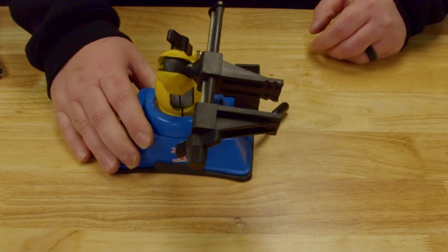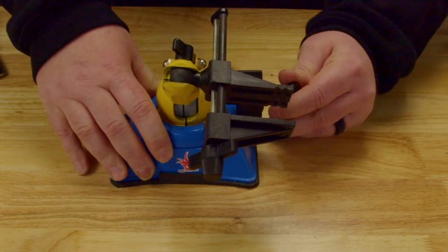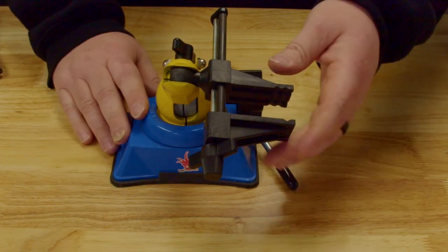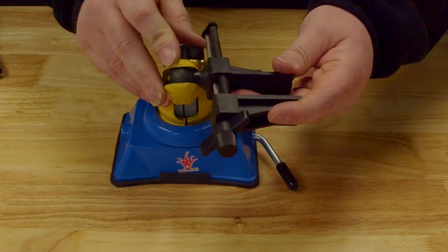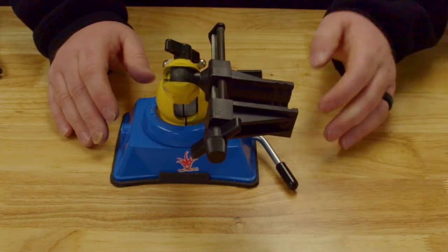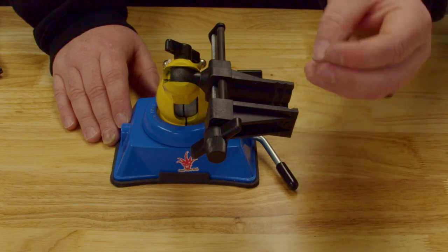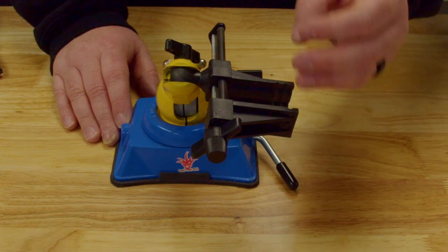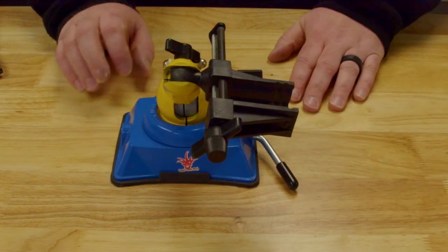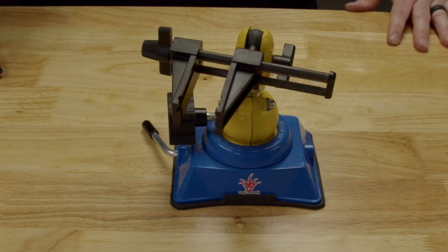So guys, the cool thing about this is once you place it on your table, you can turn this. Like I said, it's a suction cup, and it will literally suction cup itself to the table. I can almost move the whole workbench now. That helps when you solder, because sometimes you've got to give a little pressure to make sure the wires flow when you solder to the board. You want everything to melt and get a good contact between ESC and wire. Let's get our soldering station up to temp and let it warm up.